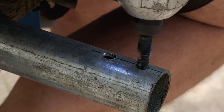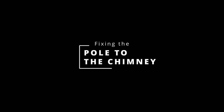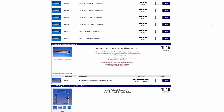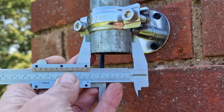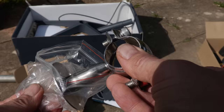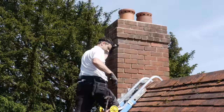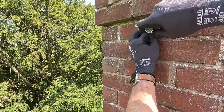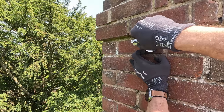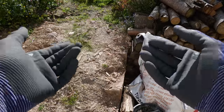I'm so pleased with that bit set — it was effortless tapping the thread into the pipe, and the new pipe adaptation was now complete. To attach the pole to the chimney I bought a box of six pipe clamps on Amazon sized for my 36mm pipe. A crucial tool was my SDS drill, as the hardness of the bricks made drilling left-handed with my combi very difficult. I marked the three screw holes on each base plate using my Marksman hole-marking tool, then drilled 7mm diameter holes for the brown plugs.